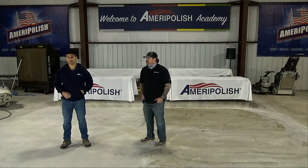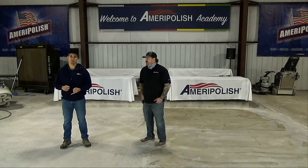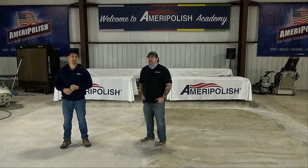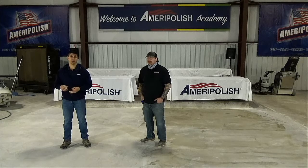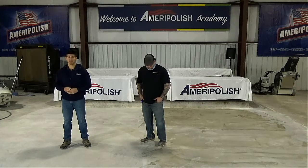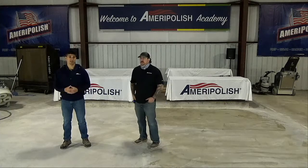A couple of things we do here: we've got this broken up into 3 different days. Today we're going to go over our first step of the SmartFloor refinement system, double zeros. We're going to show you how to put down our PG7K grout coat and then how to apply our 3DHS densifier. Because you would have to wait an hour for those products to cure, we've done some things to the floor in advance so that we don't have to sit and watch anything dry.